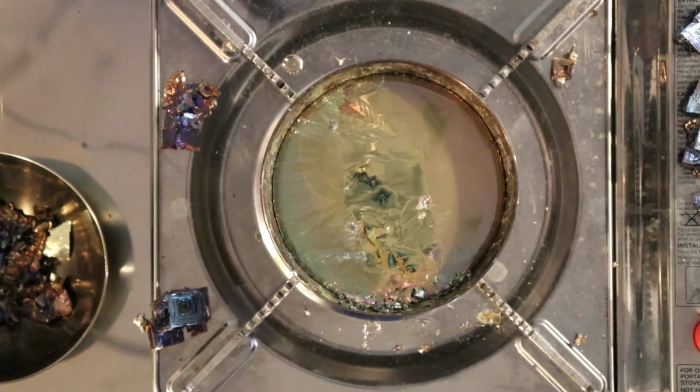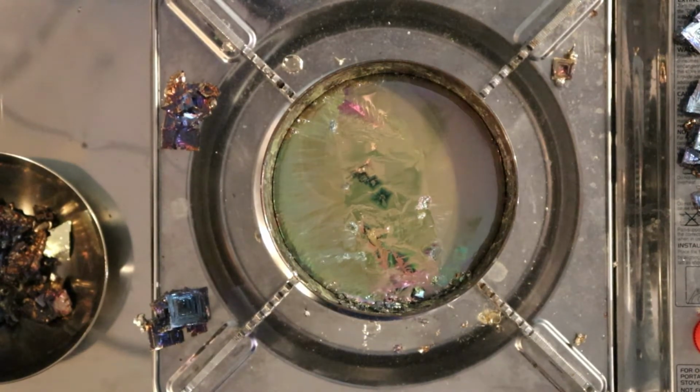Yeah, so the more interesting thing, it's not too surprising that bismuth oxide floats on molten bismuth. What is sort of surprising is that solid bismuth floats on molten bismuth. And in fact, other solid metals will also float on molten bismuth, which I don't have here, I will probably demonstrate the next time around. Like, you know, steel will float in molten bismuth. The steel is heavy, bismuth is heavier.